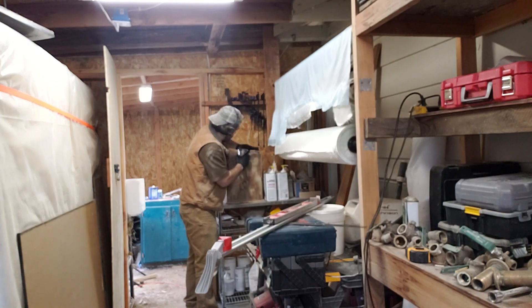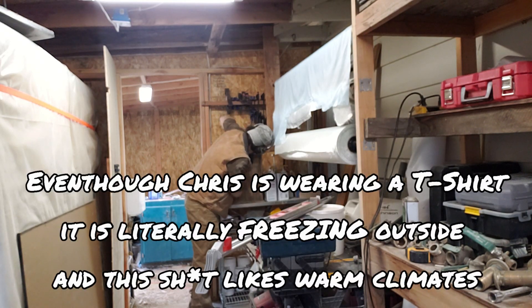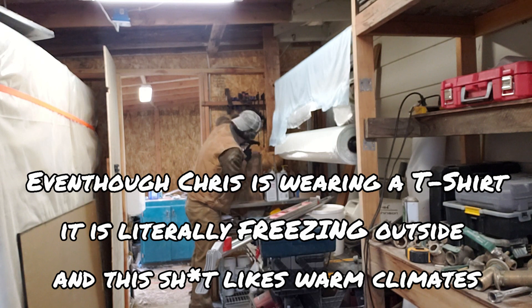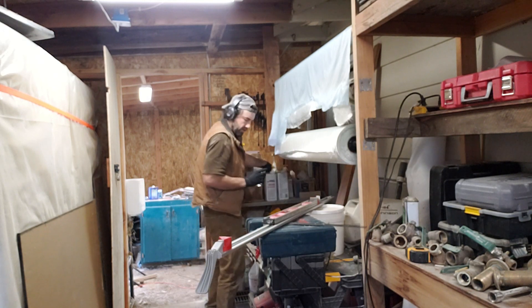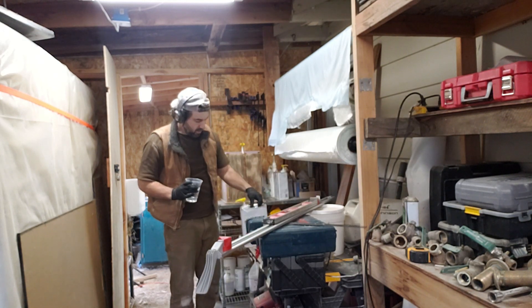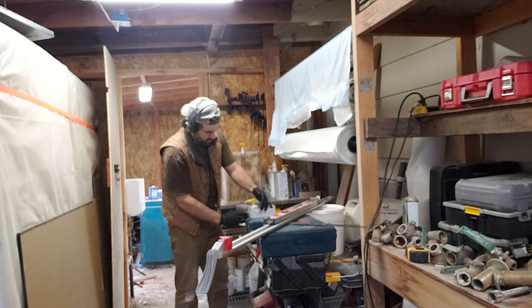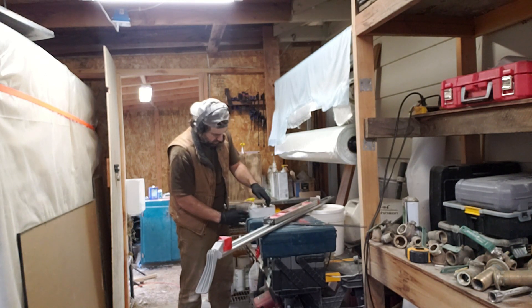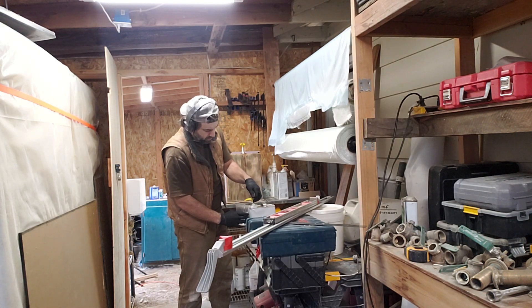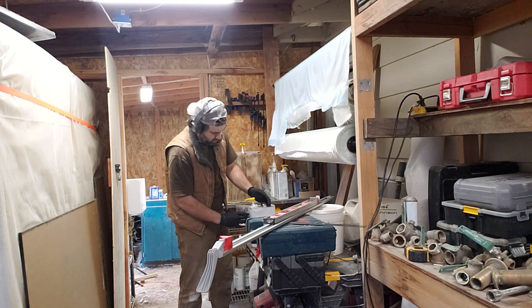I have this box, which is fairly insulative, and I also have two heating pads on the bottom — it keeps this stuff flowing. On the other hand, unheated epoxy doesn't flow as well. We have 14 pumps of epoxy, and here is the hardener. I'm illustrating the point of how much harder it is to pump this because it's not warm.